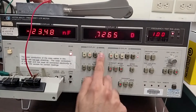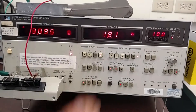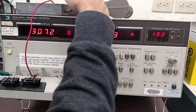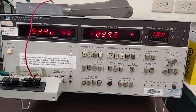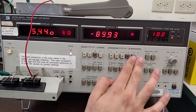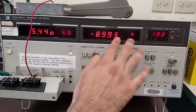Such is life — it doesn't always work. This is 7 ohms at 7 megahertz, but at 10 kHz it's about 3 ohms, so it'll be okay. Not perfectly calibrated right now, but that's fine. We're going to take this darker material, place it here. The resonance frequency of these is probably going to be around 110 kilohertz. I'm going to write these numbers down. This is the impedance at 10 kilohertz, which is significantly lower than the resonance frequency — this is what we use to measure off-resonance properties.